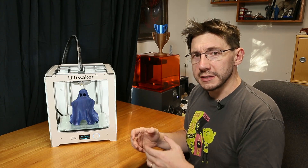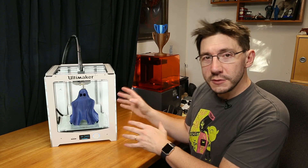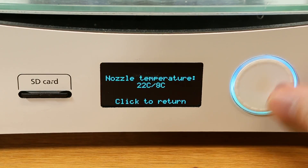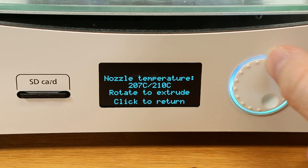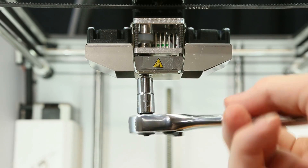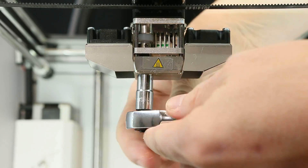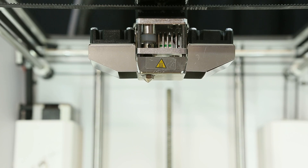You may be asking: is it hard to change the nozzles? Well, typically not too bad. It does require some tinkering of course, but at least with the Ultimaker 2 Plus they've made it really simple. First, you heat the filament; once heated, you back it off just a little bit to give yourself room to work. I use a socket driver to loosen the hot nozzle — be careful, it's hot. Once it's out, put the new nozzle in and tighten it up with the socket driver, not too tight. Since the filament is still hot, roll it through, make sure it extrudes, and that's it — you're done.